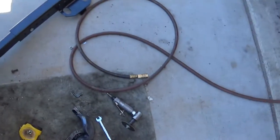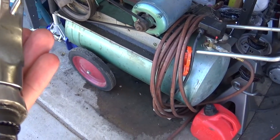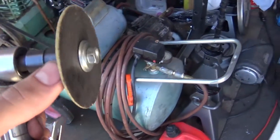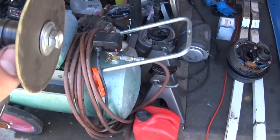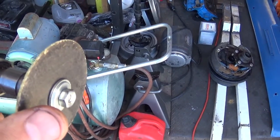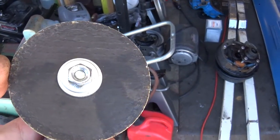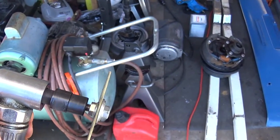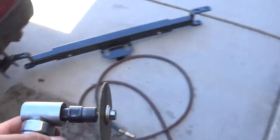To get into this side, you can't really get in there with a full angle grinder. I didn't have an arbor — I had one of those really crappy Harbor Freight die grinders that only has a thread in it, so you can only screw discs into it. You can't pull the arbor out and put it into a different die grinder. So I took my arbor for my roll lock discs and made a little adapter. I took a quarter-twenty nut, threaded it on, stuck the whole thing in the lathe, turned the nut down until it sat nicely, put a washer and a nut, and now I can use my nice die grinder with a cut-off wheel. I just stuck that in there and was able to get in and grind it out.